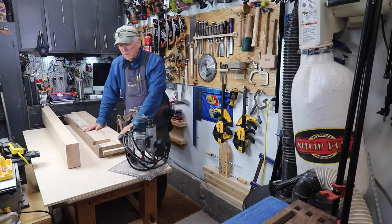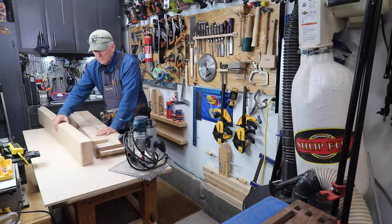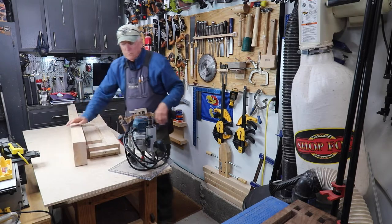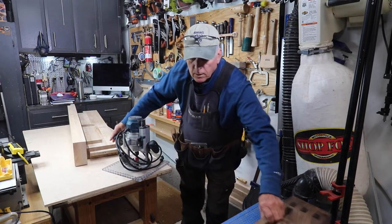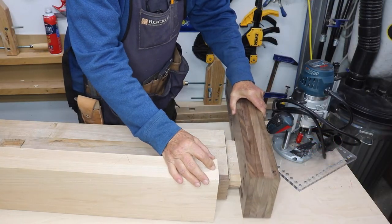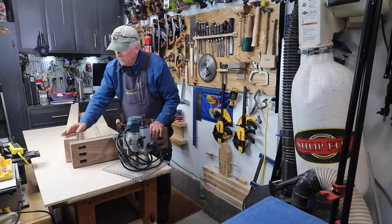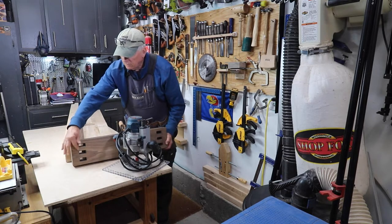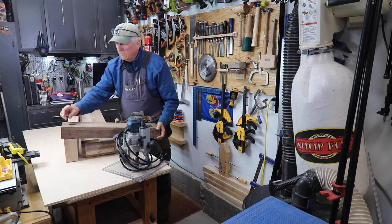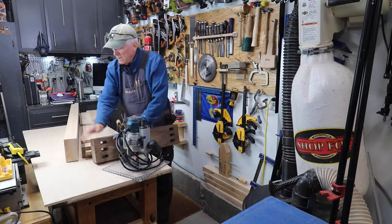I've got a bench top in progress for my Samurai Carpenter workbench. Here's about half of the bench top, and this is going to be an apron for that bench top — this is upside down. I'm going to use my router to cut a tenon on the inside edge of this board. It's going to be a one and a quarter inch tenon, first all the way through, then I'm going to cut fingers out of it to fit through separate mortises. Those are going to be split with wedges, anchored in, and shaved off. That's my project — this big, heavy workpiece.